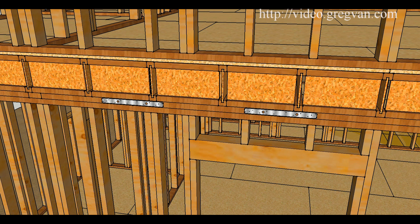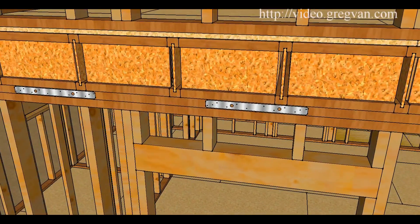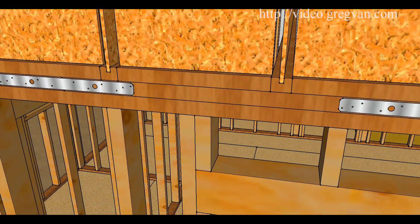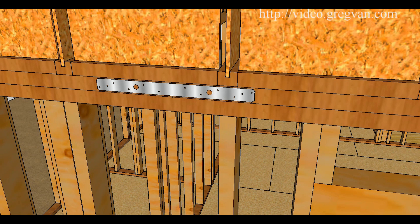Let me provide you with a better idea of what needs to be done. You have your breaks and then you have your straps. These straps will actually center on the breaks — this is a common construction practice. You can see the break and the center of the strap; some straps actually have a little mark that shows the center to help you line them up. I drew in some straps here, let's say these are 10 to 12 inches long.